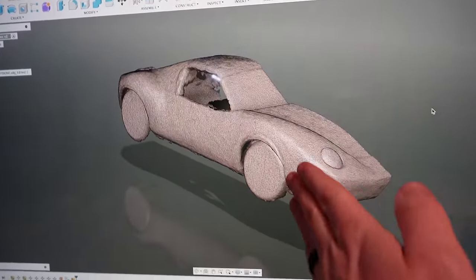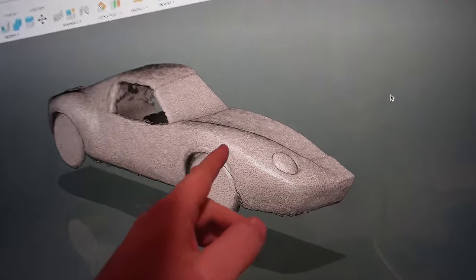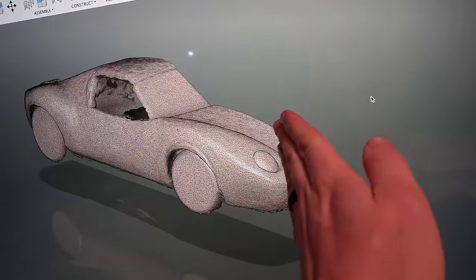Now that the model is cut in half to the correct side and leveled, I need to make templates that cut across here — maybe three for the front, three for the back — and they'll only be half sections of the car. The current working theory is I can make templates within the four-foot by four-foot area of our CNC plasma cutter and cut them out of 20 gauge steel. Part of the reason I haven't fully explained it yet is because we're still working the entire thing out and most of it's just theory right now, so stay tuned.